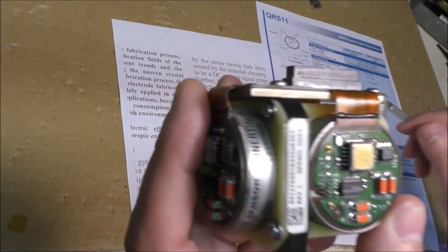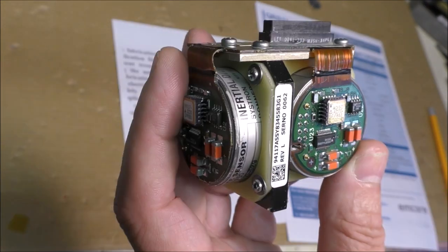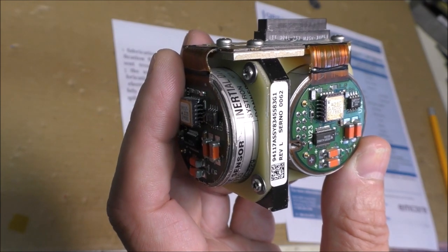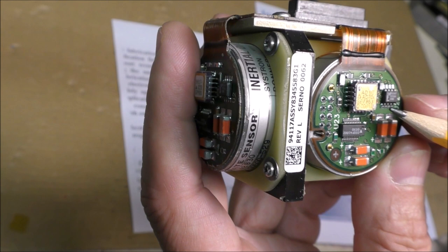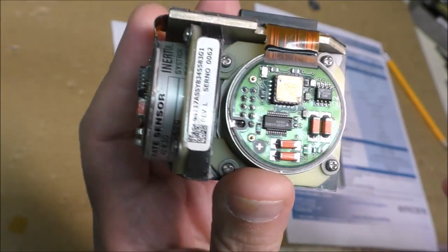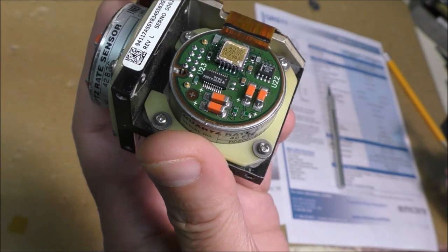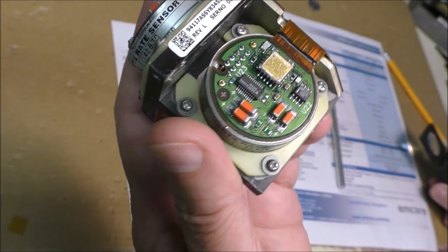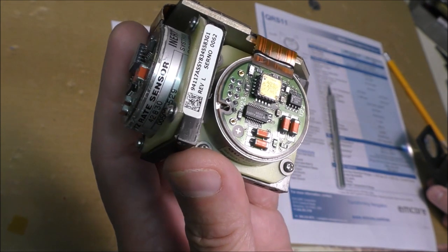Okay. So this is an AD. I cannot read AD7 or something. So this is the military part. You have the standard 883 something. So this is probably an AD704. So this seems to be a quad op-amp, because I have already used in another life an AD706.